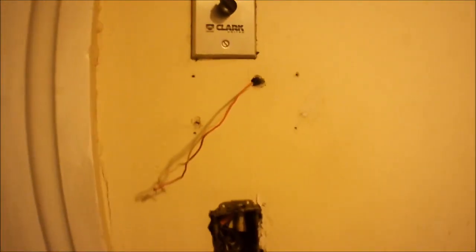You can see it in there — see that green wire? Right there, you can kind of see it. I'm going to try to pull that out with some needle-nose pliers, and if I can, I'll get lucky and won't have to run a new wire, because this needs three wires — one for the C, which is the common wire.